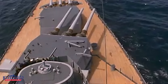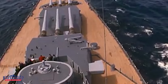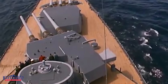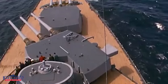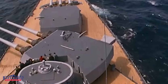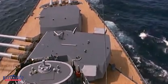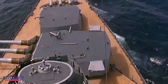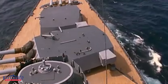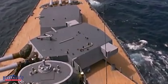The average speed for the lighter 1,900-pound high-capacity round was supposed to be about 2,615 feet per second, with similar variance over time. With fresh powder, your maximum range for the guns is a little bit over 42,000 yards, which is about 21 nautical miles or 23 land miles — that's with an armor-piercing shell. The high-capacity round, even though it's lighter, is about 500 yards shorter at roughly 41,000 yards and some change.